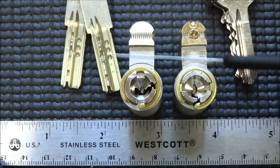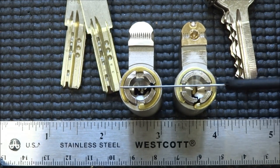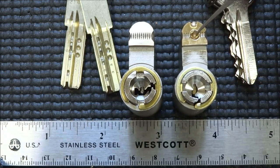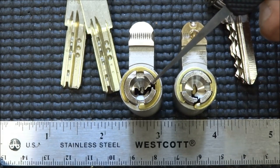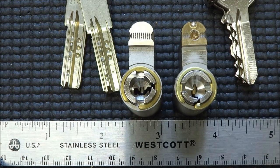So what I need to do, first of all, we need to cut a groove right through here that's identical to this one. And we'll do that on the milling machine. The next thing we need to do, we notice we have a threaded hole here. Once we get that groove and the actuator lined up, we'll mark the hole, we'll drill it, we'll tap it, and we'll fit the screw. And then it'll go into the body. Let's see if we can't make that happen.